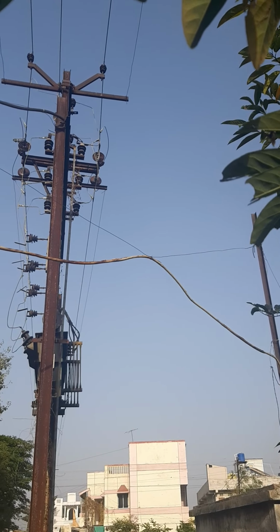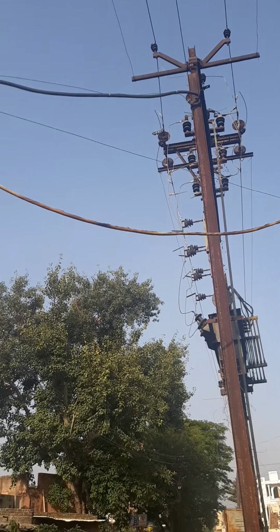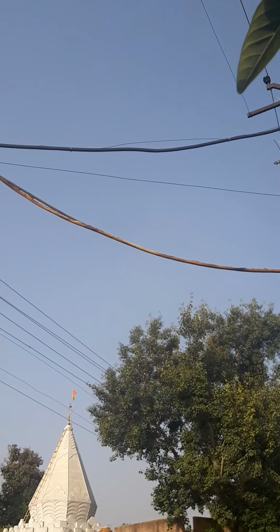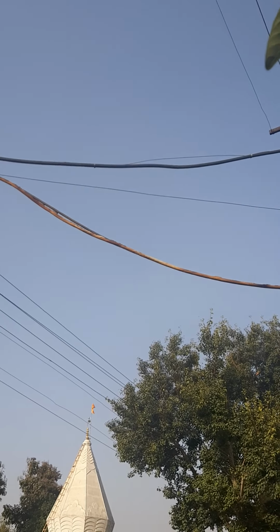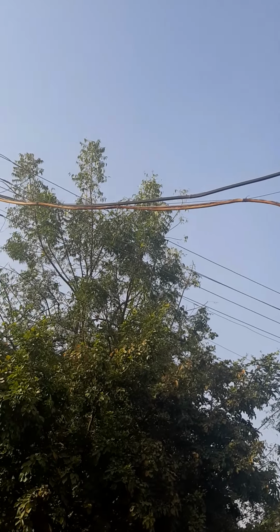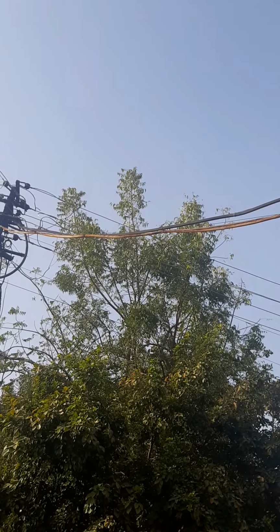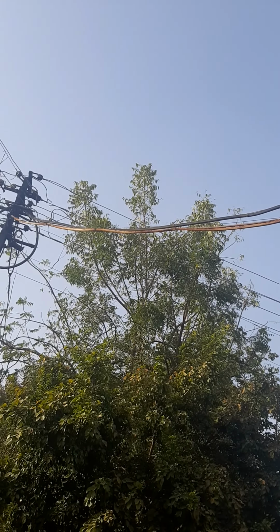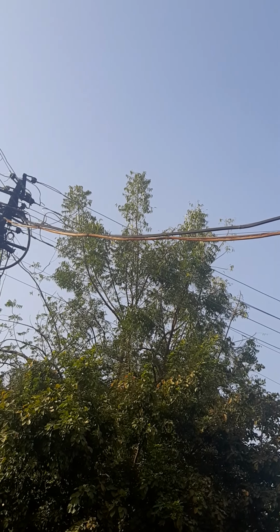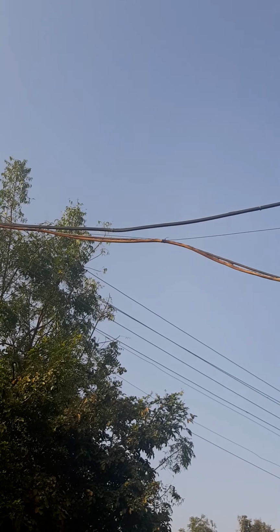the cable mechanically, and it is a basic principle that every cable has to be supported with a proper mechanical scheme, that is a GI wire, reel insulator, and the minimum distance between two insulators, etc.